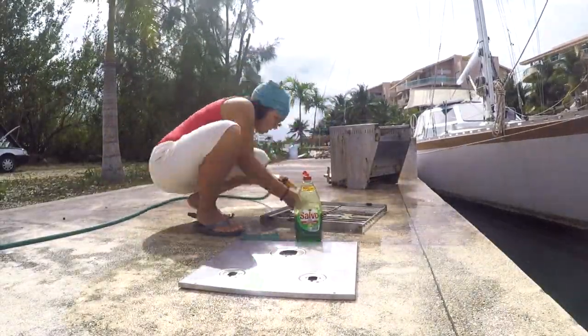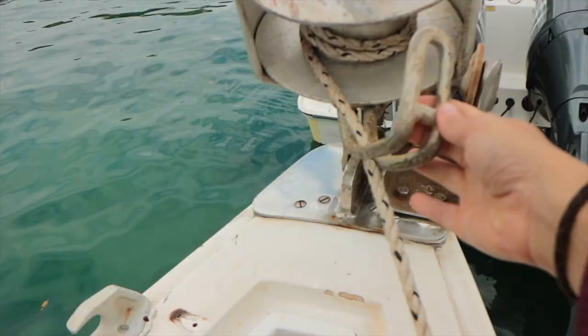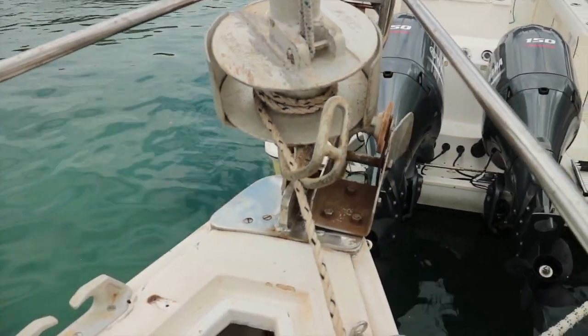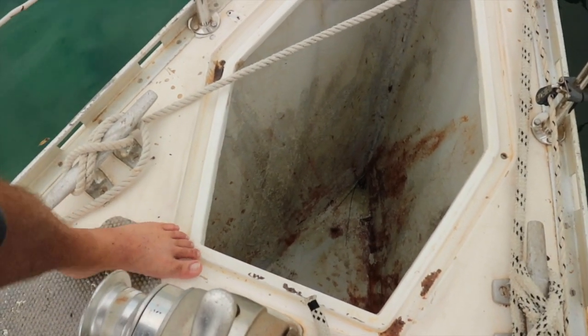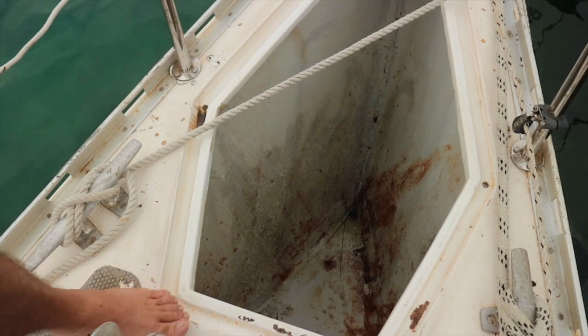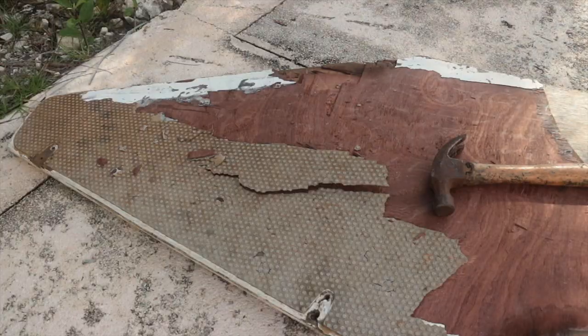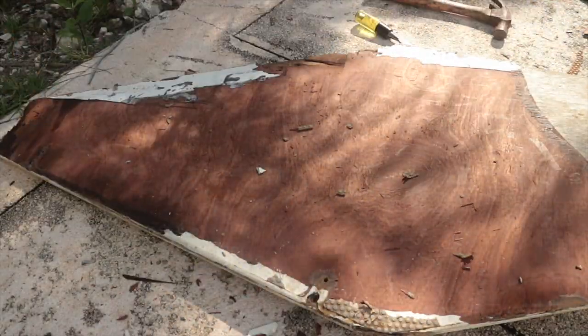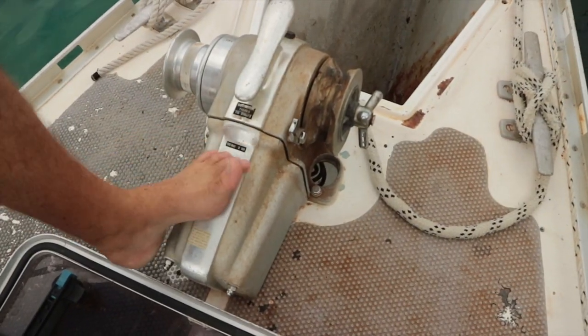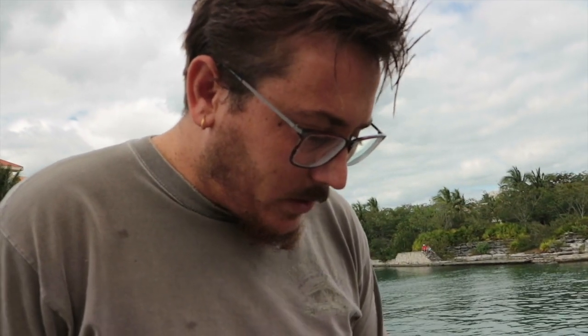Time for a walk through the whole boat to look at just some of the work she'll need. All of the bearings have to be serviced. This piece has to be straightened out. The nav lights have to be rewired. We took all the chain out — Robbie did his best to clean the anchor locker with some Ospho and some anti-rust. The anchor locker lid is under the grinder and sander right now. The windlass works fine, but it does move a little bit under strain, meaning we probably have to reinforce the bottom of it with some wood and epoxy.